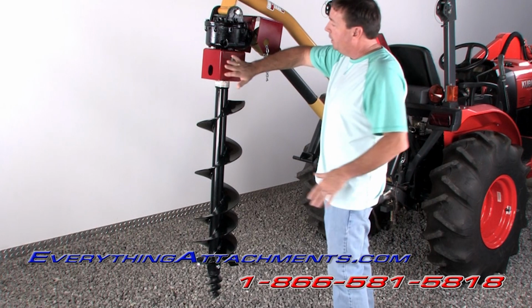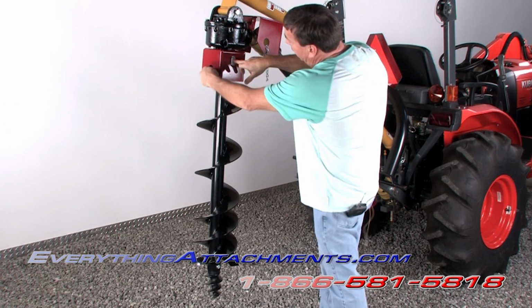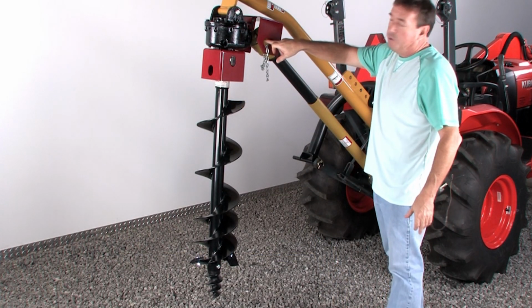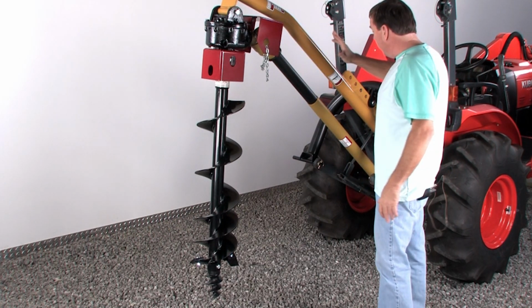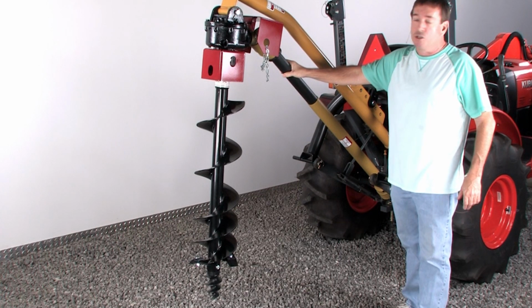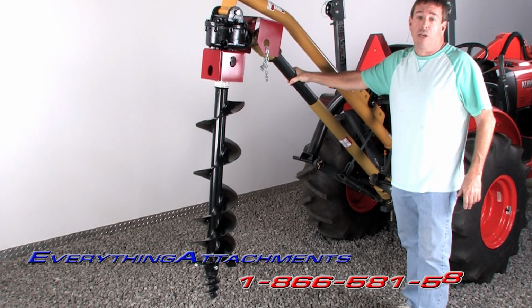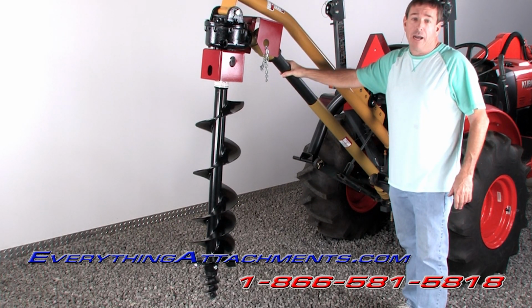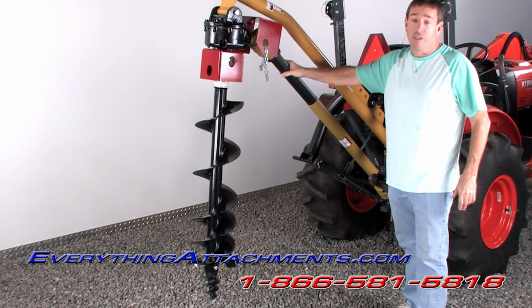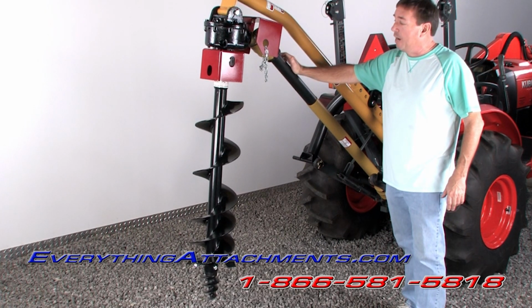We've changed the guards on here where you don't have to take them off to take the bit. We've put 2 different heights of holes to remove both pins here. We've got the hole through here to remove the shear bolt. Even on the little bitty post hole diggers, we're using a heavy duty shaft. On this tractor here, this is a category 4 PTO shaft, and almost everybody's, until you get to the really heavy duty, uses a category 2 PTO shaft. So we use a shaft that weighs about twice as much. We never have shaft problems.